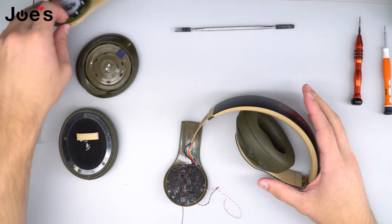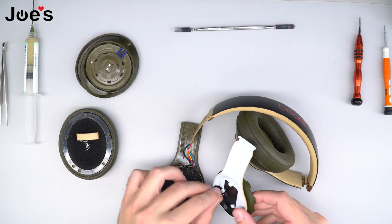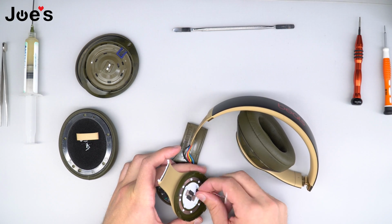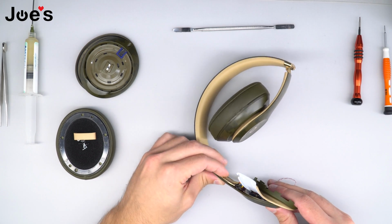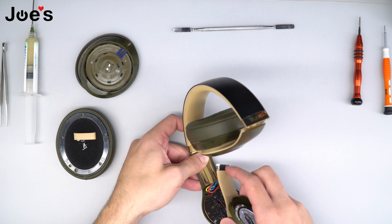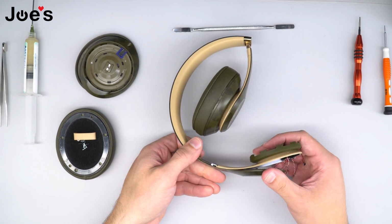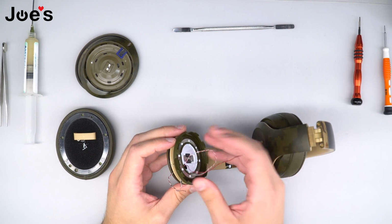Once all 4 screws are in, we're going to take the inside panel, and the first thing that we're going to do is go ahead and feed the wires through the opening. Once you have that done, go ahead and press the hinge into the outside panel, and there are rails on both sides, and we're going to make sure that these 2 tabs slide right in, aligned with the panels, like so. Once that is done, go ahead and just push, slide, and sometimes the wires will pop out.